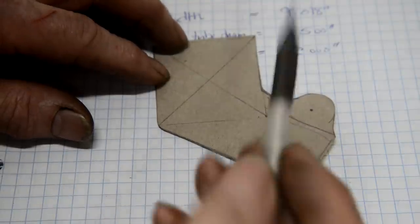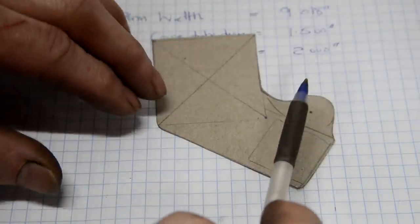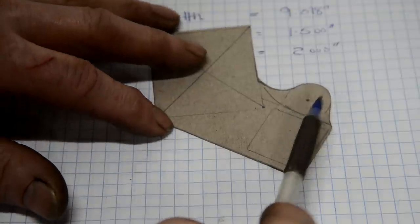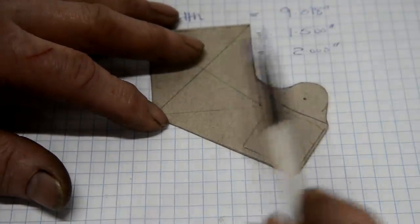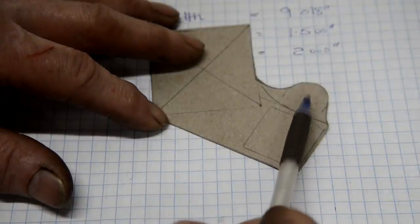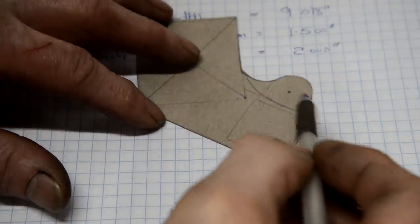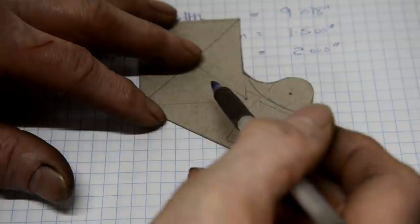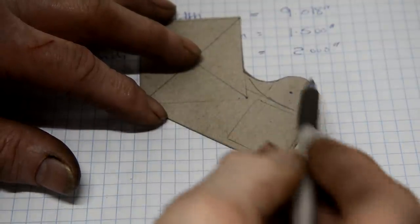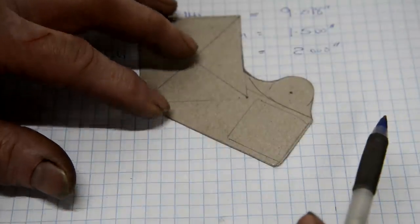See, if I use, like as now, I'm using a Japanese rear hub, the brake plate is going to be on the right hand side. So if I want to keep the brake pedal on the left, I'm going to have to run a cable over or some sort of cross shaft. Or if I'm going to put it on the right, which is what I think I'm going to do, just because most people are used to the brake pedal being on the right, and on the Triumph with the kickstart I can get for it, the brake pedal won't foul anything. I'll have this plate on both sides, so you could swap it over.